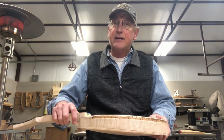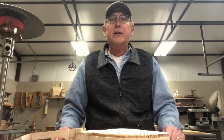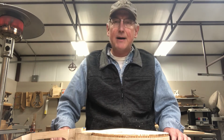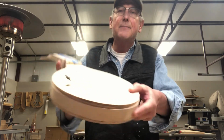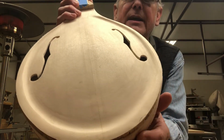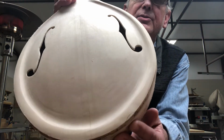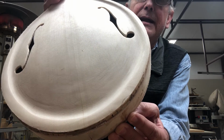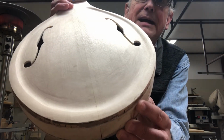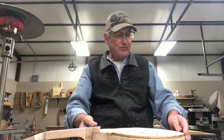In fact, I made two mistakes. I cut this channel a little deeper than I intended, and it was because of just not being aware on my part. I let my mind wander for a second. And the second mistake I made, if you'll be able to see this, right here, there's a little half moon that I cut. Purely mistake, let the router get into it. And so I cut another little matching piece and glued it in. Hopefully when I stain this, you won't be able to see it, but it's noticeable now.